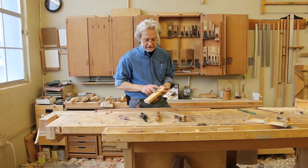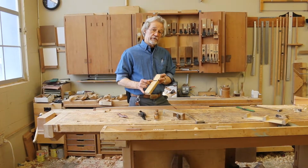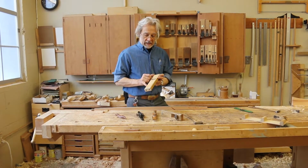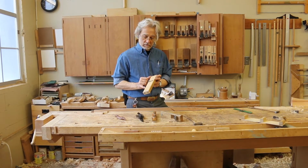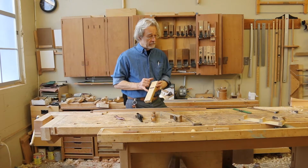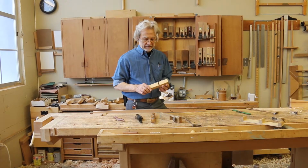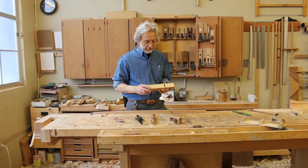The advantage of the Japanese is it has a long area in front of the blade. This gives you good reference to start to cut. And if you make your own plane, say in a Krenov style, have it at least centered. Western wood body planes have the blade set back only about a third from the front, and that is really awkward in starting the plane.